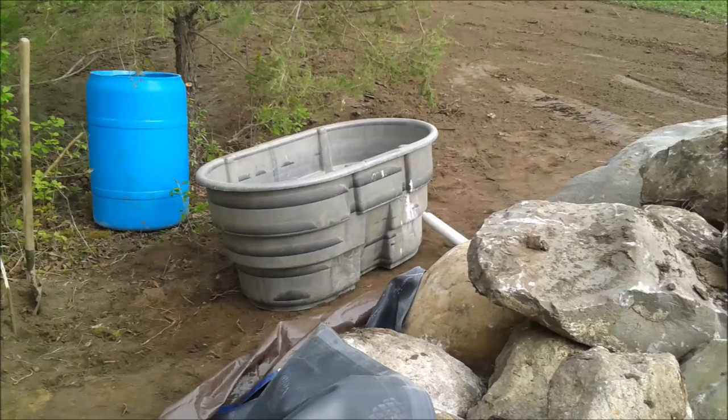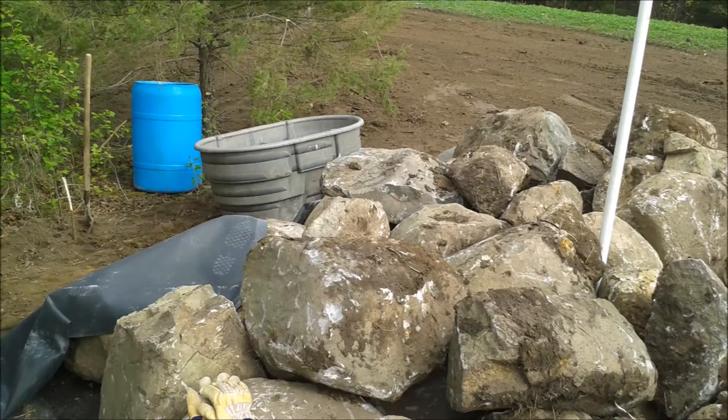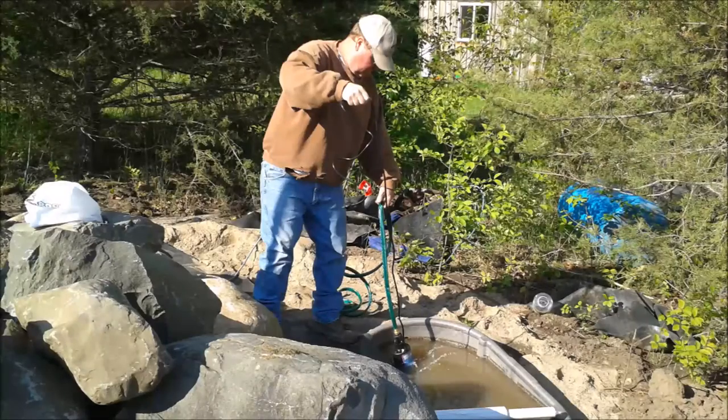You can see our gray collection tank — it's a 100-gallon tank. We're going to put that in the ground with our pump inside, and that will run water through the PVC over the fountain. We'll use an excavator to dig a hole so the tank sits in the ground, ensuring the pump doesn't run dry. We bought a 4,000-gallon-per-hour pump that cost about $180 at Menards.